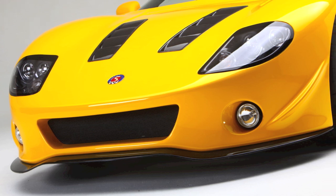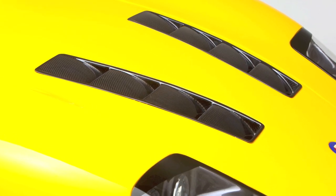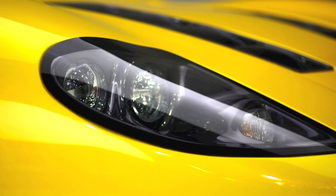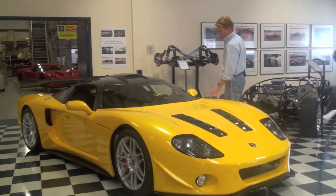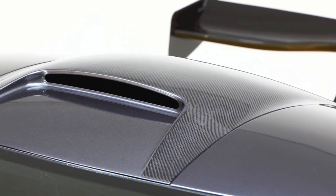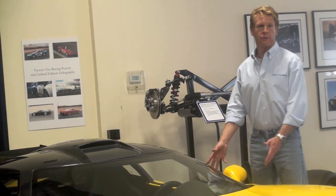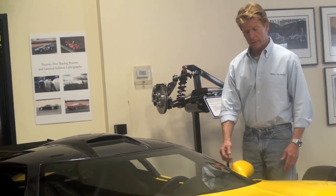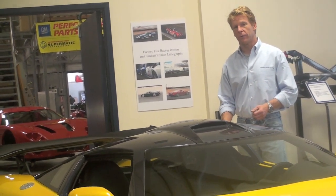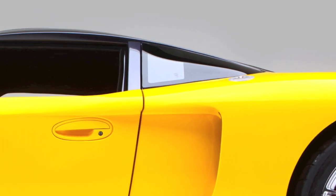You've got a smaller aperture, you've got those canard mounts on the front, you've got the details on the hood, and the inset hood vents. We used carbon fiber on this car — they come standard in fiberglass, but you can order the carbon fiber. The headlamp buckets were easier to do. Going back on the car, the center roof scoop is a functional roof scoop. That means it vents hot air from the engine when it's parked, but it also feeds fresh air when you're driving. The doors open and close a lot easier now because of those A-pillars. We changed these rear quarter windows from polycarbonate to glass, so now all of the top glass is actual glass — there's no polycarbonate.